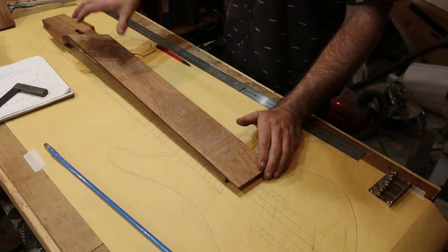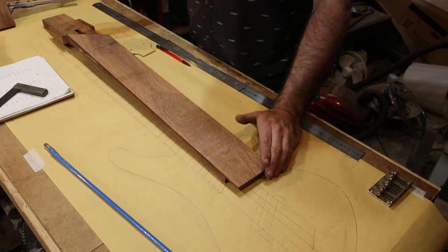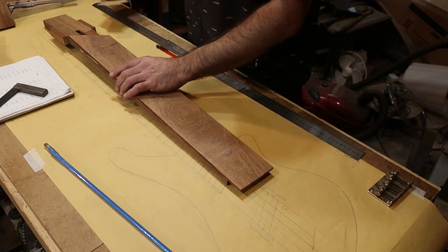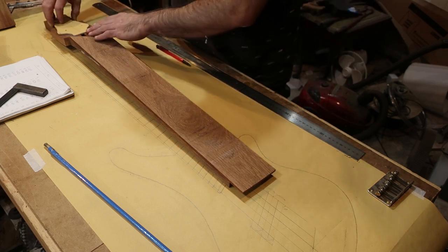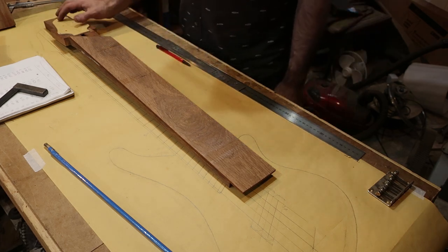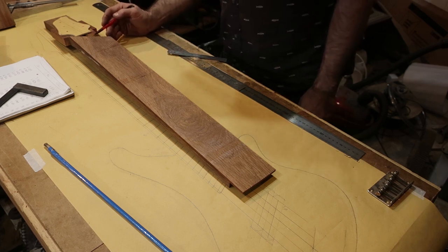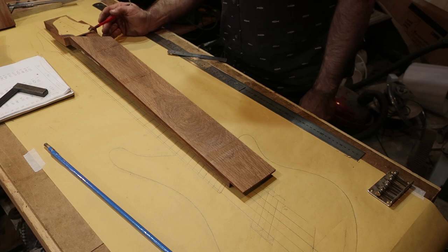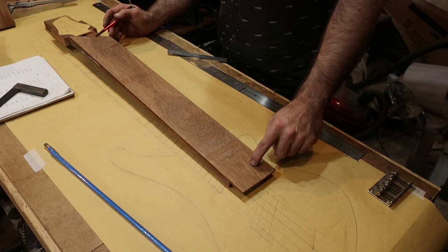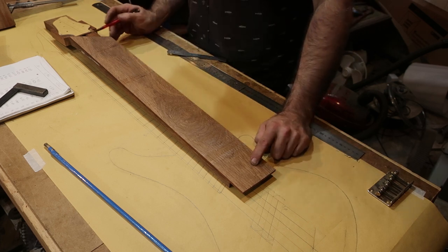When I constructed this, I started in my mind with the idea of how to construct a standard neck. Now, this is non-standard. Essentially, what's happened is that I had banked on having the headstock about there. Of course, it isn't. It's going to be there, and we've even got more of a gap here. And effectively, what's happened is that because this point has shifted down there, we've actually lost that much distance off the end of the neck that way, because the blank wasn't long enough to accommodate for that.